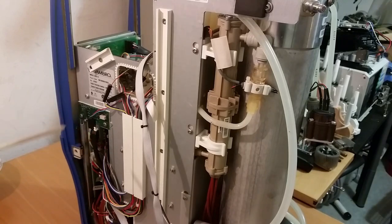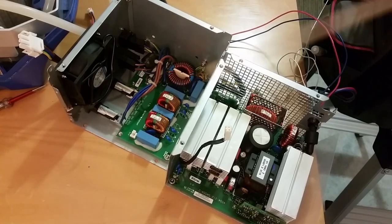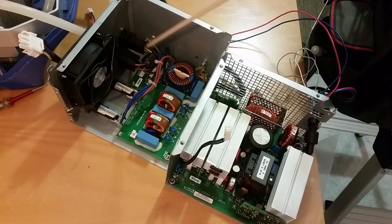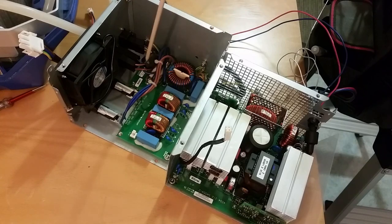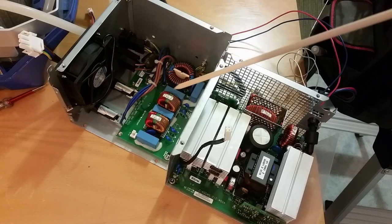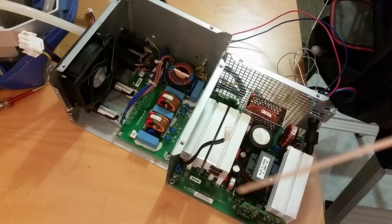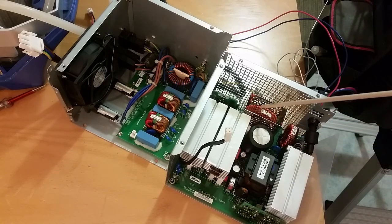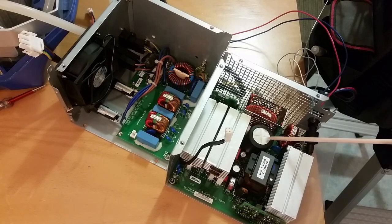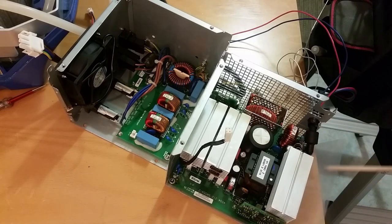Here we have the main circuit board that controls everything, and here you can see the power supply. The input is here. We've got a big interference filter, two fuses — one for phase, one for neutral — and two additional phase fuses here as well, because when you drive this on an isolation transformer you need two fuses for safety reasons. On the other side we have the rectifier on this heatsink with the switching transistors, the switching transformer, the diode rectifier, some filtering inductor, smoothing capacitors, and what looks like the large primary capacitor. And here's the output.